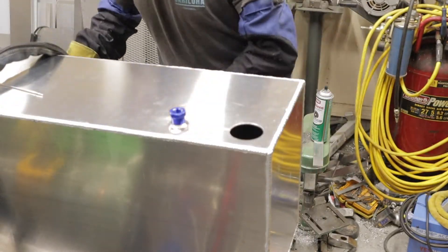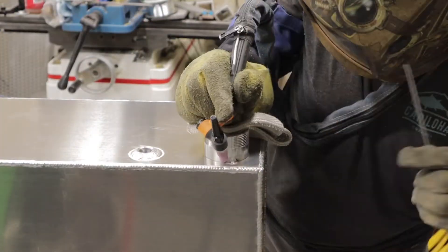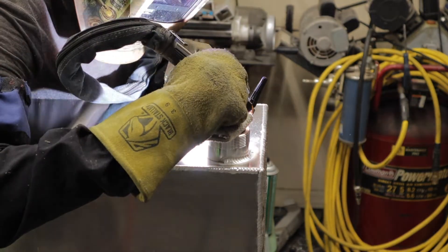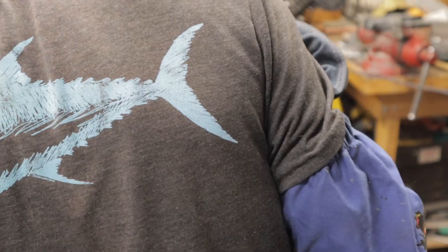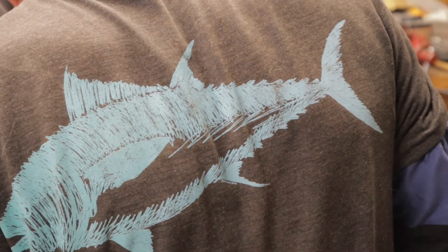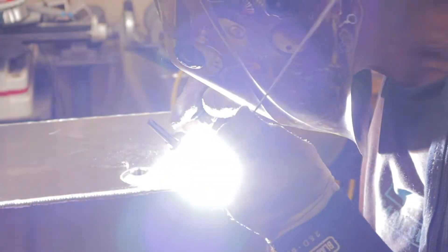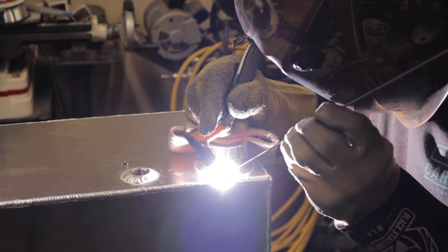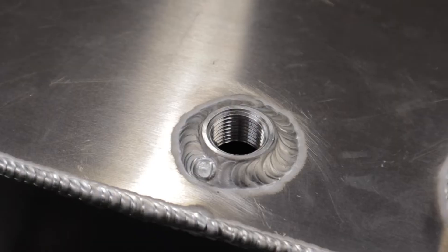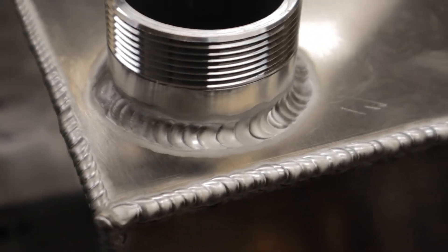For the main fitting here I'm using just a TIG finger for the pivot. I have it set up on top — this protects my hand from the heat and also reduces friction due to the fiberglass. It works really well. Being on the corner makes it nice for being able to do this filler neck in one pass around half of it, and then one more pass to finish up. On a lot of round fittings when there's pipe sticking all the way up you have to do thirds or four sections, but this makes it a lot easier and protects your hand, giving you a nice smooth run around the fitting. Here you can see both of the fittings welded in, with a nice button at the end so this thing never cracks.